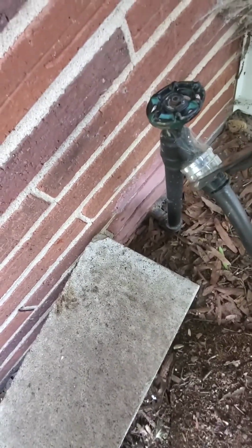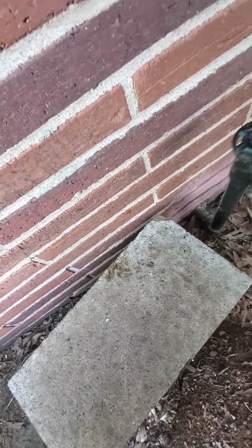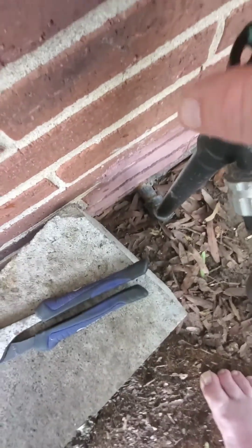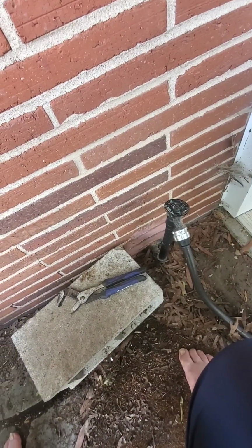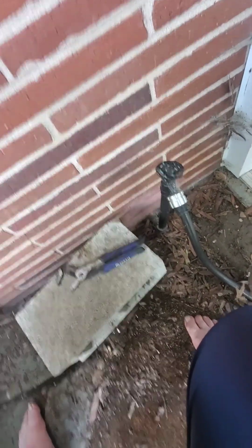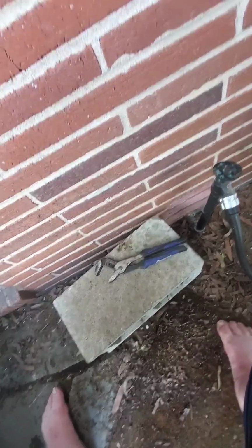Alright, now I actually came across a problem. This is an old contractor trick. I notice I'm grabbing this and I'm trying to turn it, and because we're on a brick foundation and I got a tile ground, this cast iron pipe's in here and it's wanting to move, but everything's dry and there's no leakage, so I don't want to mess up anything that's not already messed up. I'm gonna use this cinder block as a stopper, and I'm gonna press it against it and hold it with my foot while I turn the dial.